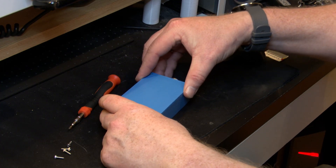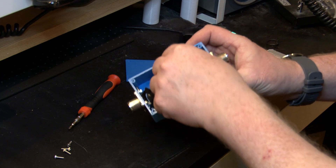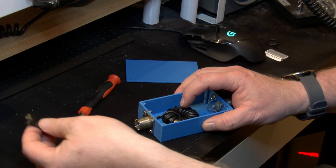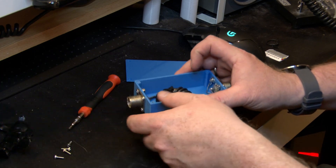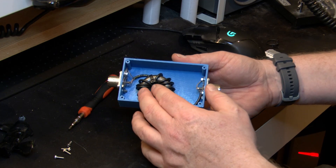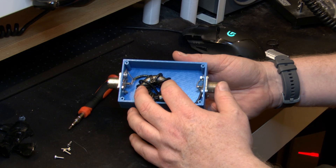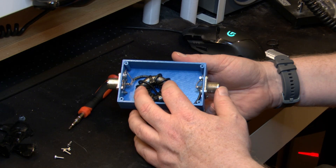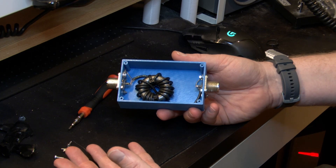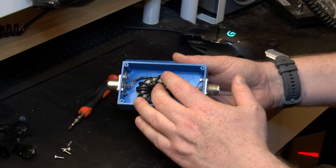Let's flip the lid off here. There's a bunch of electrical tape — I'll just remove that — that's just a temporary solution until I've tested everything works well. Here you can see we've got some RG174 wrapped 14 turns around a 43-140 core. That's a common mode choke, nothing more complicated than that, but it is a problem solver.